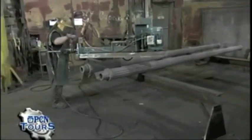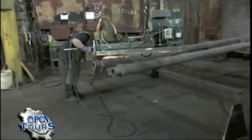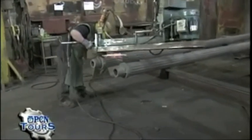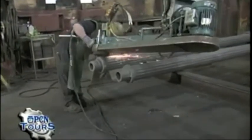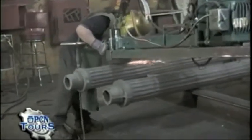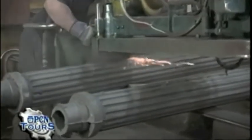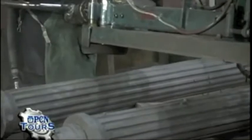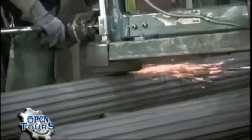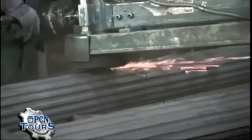What we're witnessing right now is Jake Bray, an employee who's been here for almost 10 plus years, working as what's called a swing grinder. He's taking this heavy grinder and grinding off those chaplets — those little portions of casting sticking up outside of the shaft. Those are what was supporting the core, and parts of them are still sticking out as he grinds them off.